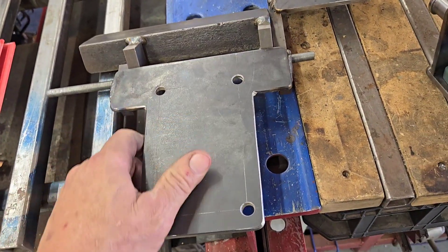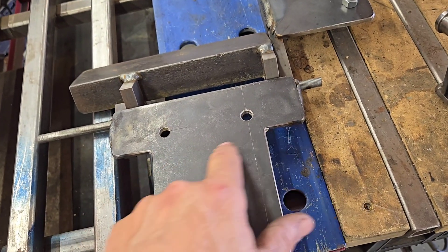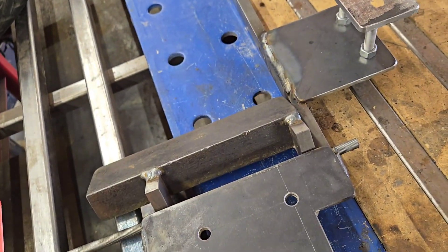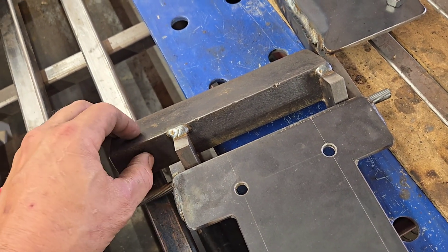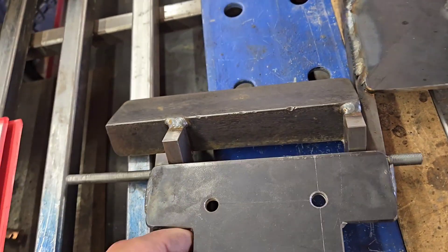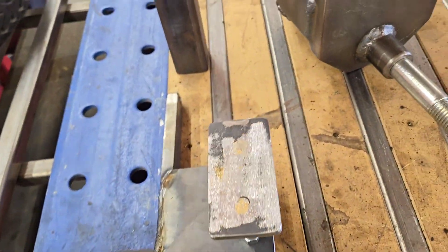This is the motor pivot and brake pivot plate. The only thing I did different was the plans call for two pieces welded together, but I've never had much luck welding two pieces of quarter-inch plate and having it square and flat without extra work, so I just cut it out as one piece. I didn't have the inch and a quarter angle iron, but I had some five-sixteenths inch thick two-by-two, so I cut the top part to inch and a quarter and the bottom to one and a half to make it beefier. I'll probably use shoulder bolts for the pivots when I get that far.